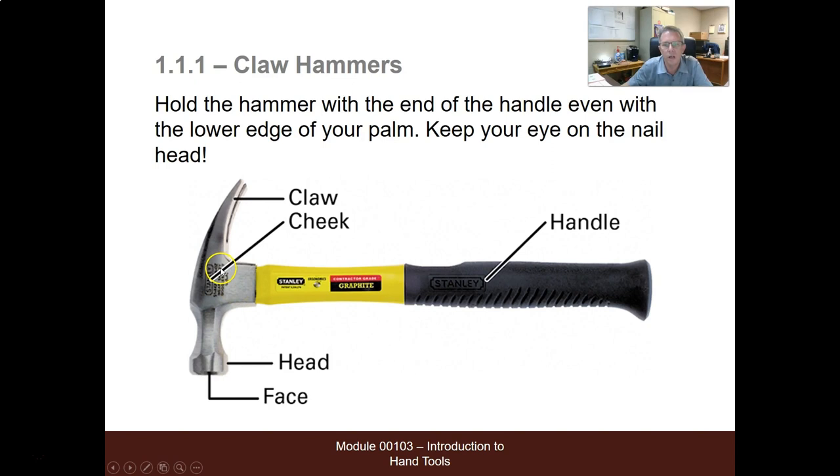Keep your eye on the nail. When nailing, chopping wood, sledgehammers — anything — this is what we want to do. If I want to drive a nail right here, I'm going to take the hammer and rest it right on top of that nail. I'm going to draw it straight back and straight down. If I do that, I will consistently drive that nail straight down. It's when we start swinging from anywhere else other than right on top that we mis-aim and damaged stuff.